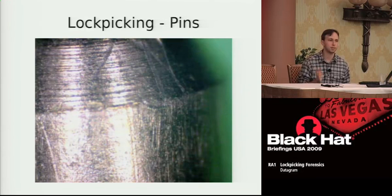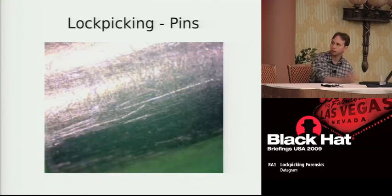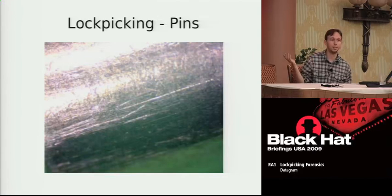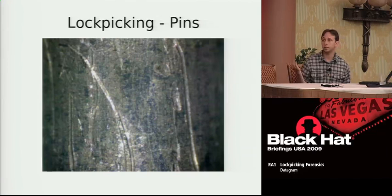But the marks on the sides are just something you're not going to fundamentally be touching at all with a key. You can see here some more marks. So here, and these are very long. These are places a key will very likely never be able to touch. And they're very distinct. Obviously, a key's not very thin with scratches like that. Again, these are an example of a low-skill attacker. These are very deep gouges on the sides of the pins.